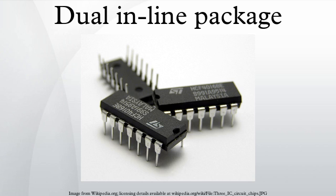The necessity of laying out all of the leads in a basically radial pattern in a single plane from the die perimeter to two rows on the periphery of the package is the main reason that DIP packages with higher lead counts must have wider spacing between the lead rows, effectively limiting the number of leads a practical DIP package may have. Even for a very small die with many bond pads, a wider DIP would still be required to accommodate the radiating leads internally. This is one of the reasons that four-sided and multiple-rowed packages such as PGAs were introduced. A large DIP package has long leads inside the package between pins and the die, making such a package unsuitable for high-speed devices.